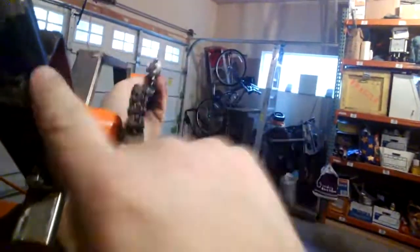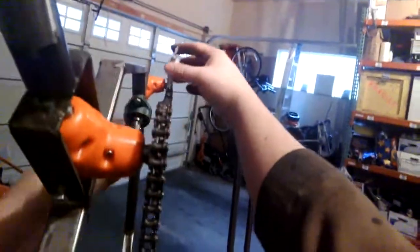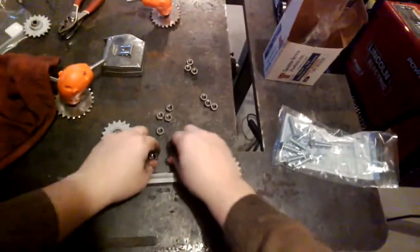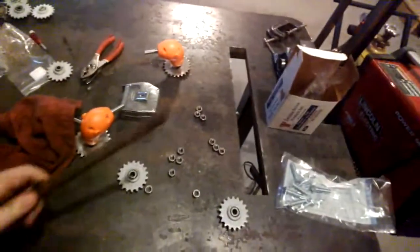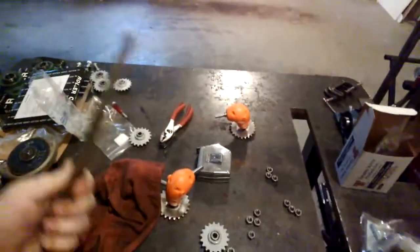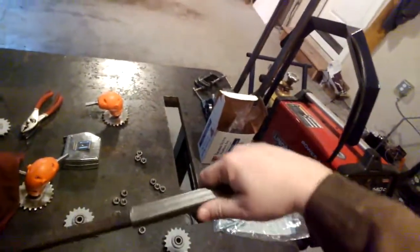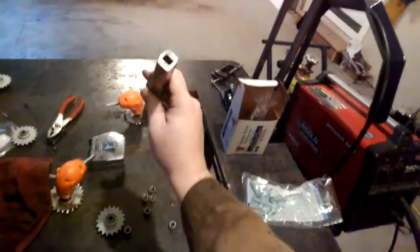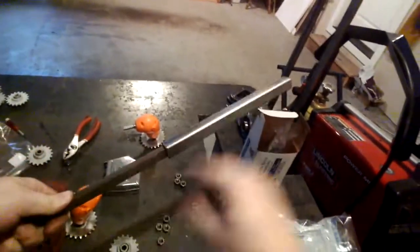Given the weird mounting here and everything, getting that exactly right the first try - I'll do my best - but it's nice to have some leeway on that. So that's how we mount the sprockets. For the adjustment plate, I have a whole bunch of this half-inch square rod. I use it for blacksmithing a lot - it's sort of one of my standard bits of stock around the shop - which, since this is eighth-inch walled three-quarter inch tube, happens to fit very nicely inside, or will once I clean up this old piece.